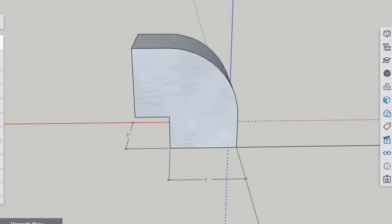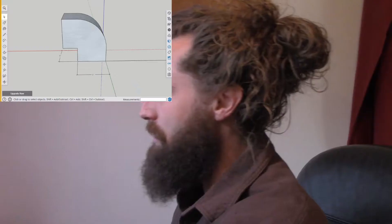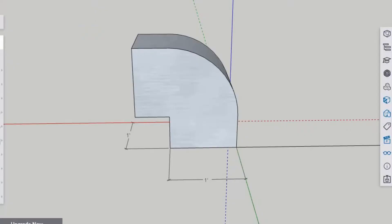Let's say underneath this elbow on my screen we have a vertical duct or furnace. This is a 12 by 12 duct and we've got to make a 90-degree bend and shoot it across the base. There are a couple of different ways we can bend that air. In order to design our system, we have to know the length equivalent of this elbow so we can design for our friction drop and total effective length. When looking at elbows, we can go into the Manual D catalog or your software. This particular elbow has a nice radius on the outer edge but a hard 90 on the inside - the benefit is it fits in a more compact area.